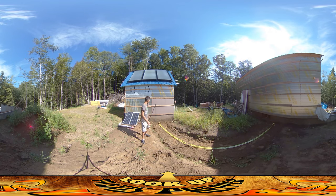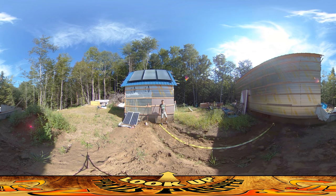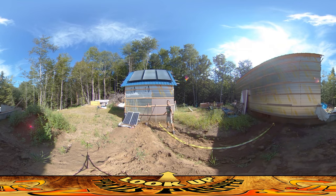The only stuff left to do out here is around the shed area. I want to build up a little bit of a wall because the footing isn't very deep — I think it's a four-foot wall but there's probably about two feet exposed, so only another two feet down to the footing. That's not deep enough for safety with frost in the wintertime.